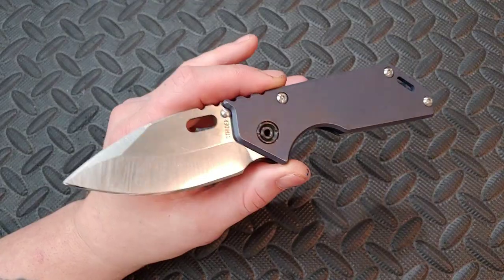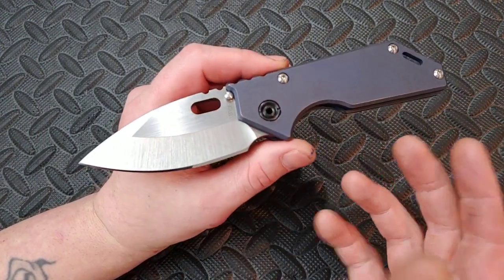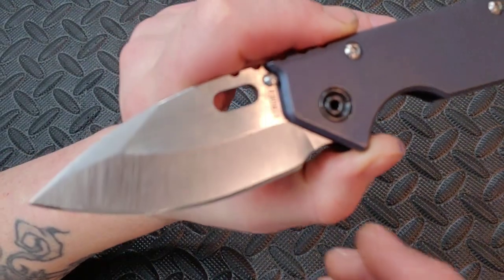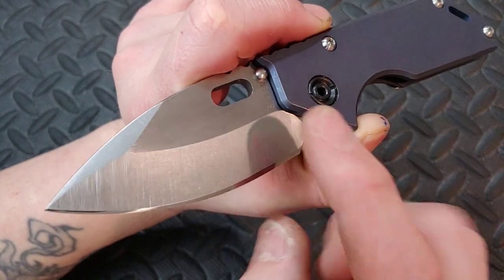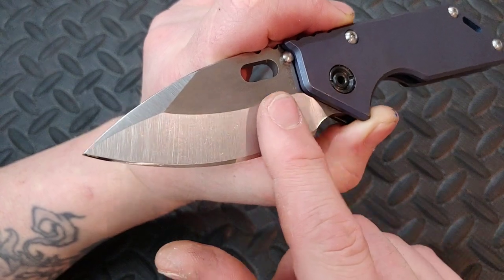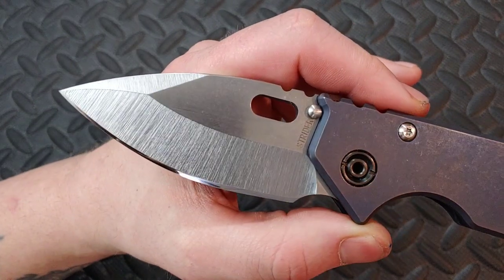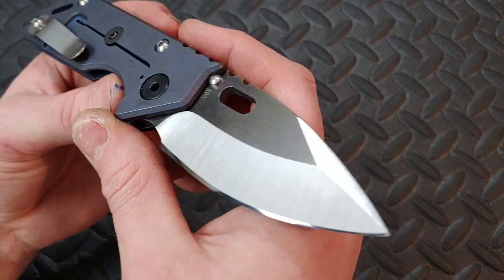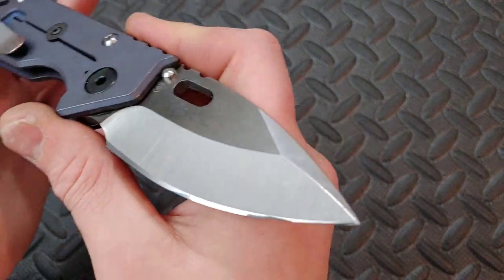This is a hollow ground blade. It's not a deep hollow, but it's definitely a hollow and it's beautifully done. This is a hand-done hollow grind. The way I can tell is if you look at the satin machine lines, they turn right here. That's how you can tell it's done by hand — because if a machine did it, they'd be straight across, meaning they wouldn't turn at an angle. See how the lines start turning? Only a hand can do that. Machines don't do that. Machines always go straight, at least as far as I know for hollow grind. That's really cool and it's well done — very, very well done. It looks beautiful.